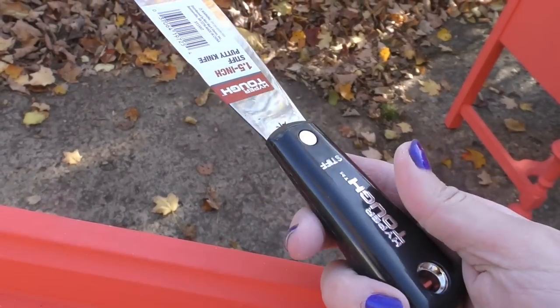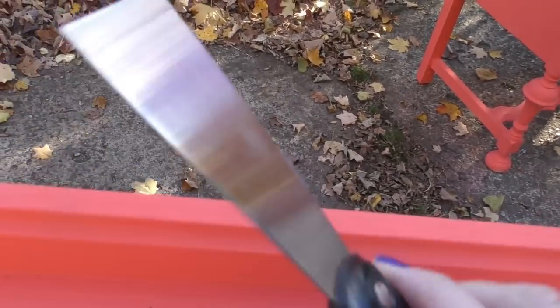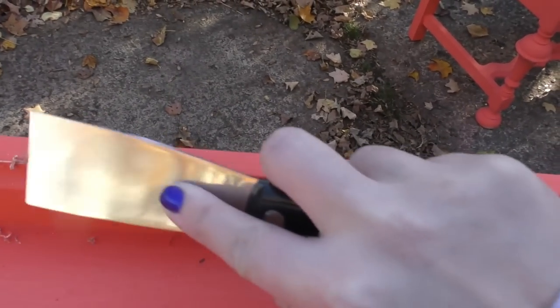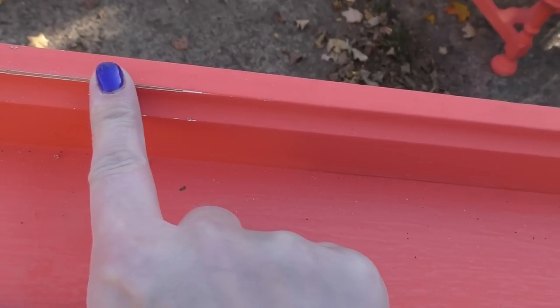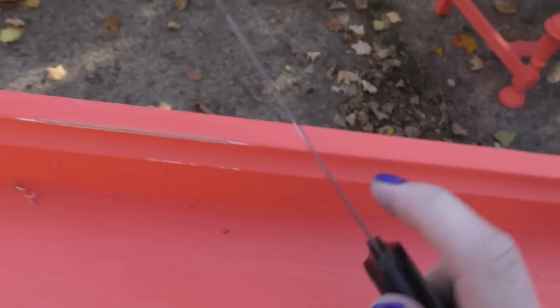When I distress, especially on a flat surface, I take my sand pad and go with the flow of the grain — the same way I painted it. My paint follows the grain, my sand block follows the grain of the wood as well. Now another way to distress is to grab a metal putty knife. If you don't want your distress marks to be really heavy, you can use one of these metal ones because it sticks into the wood and gives you a cool distressed look. It's an actually easier way to distress because this is sharp and it digs in and just takes it right off. You'll see how your lines are a little more clean and lean — so if you love clean and lean distressed lines, this is gonna be a great tool for you.